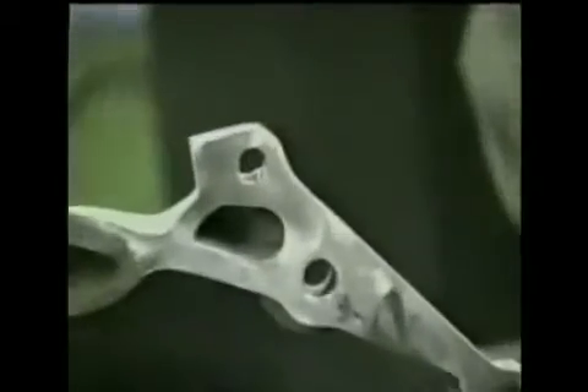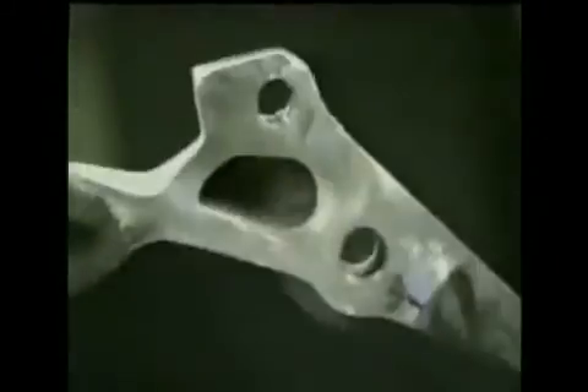When just part of an ear is missing, like in this case, a steel bolt, a nut and two washers work easily to form a new one. After the broken area is tinned, the rod is melted over the bolt in between the washers. When cool, the bolt is removed and the ear is sanded and shaped.